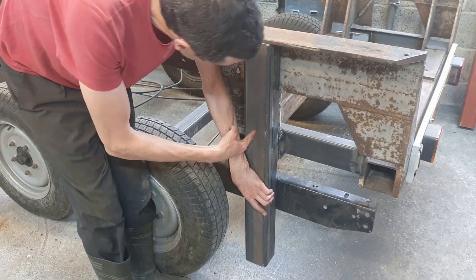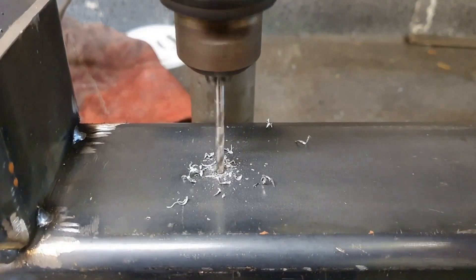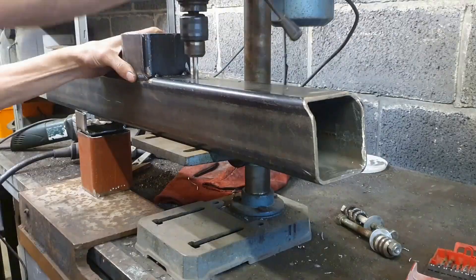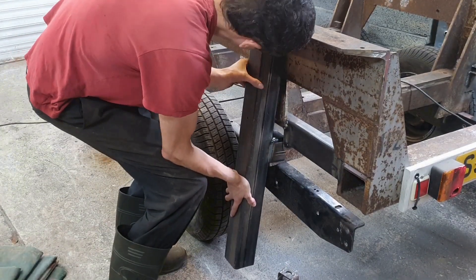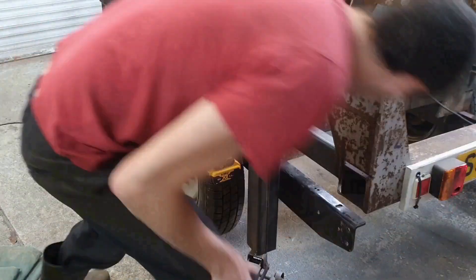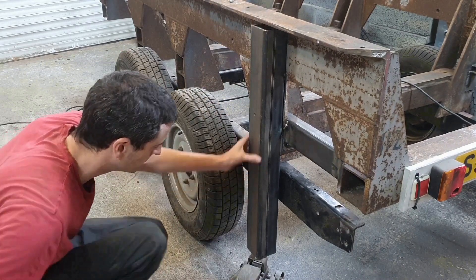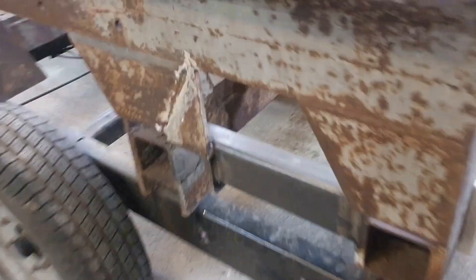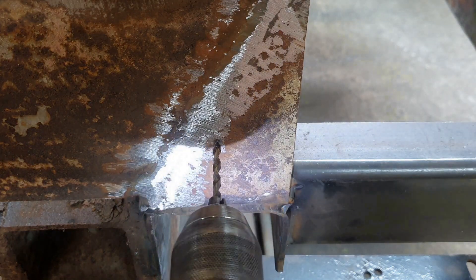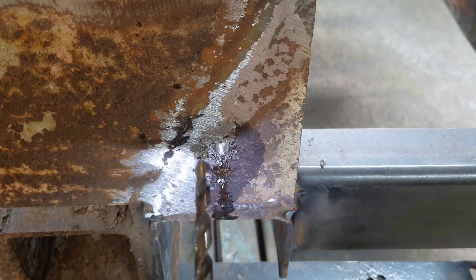There we go. So a single bolt now will go through there into this 15mm plate. I'm just going to drill those out — I think it's 9mm I went with. I stuck with 9mm, which is actually too small for the M12 bolt obviously, but I used 9mm to accurately locate the hole in the rolling road. Then I put the leg on, jack it up, hold it in place and now I can translate accurately that hole into the rolling road. I only do a little bit just to mark the hole. So this first leg is the important one — the accurate one. I work all my workings out off that one, so now I know where to drill. We start with the 6mm, finish with the 9mm, and later on I take all these out to 12mm.